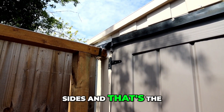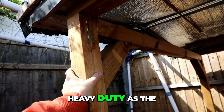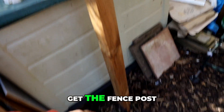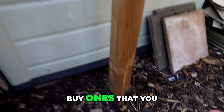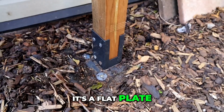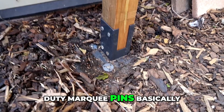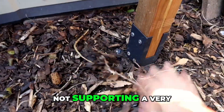As regards the supports, they don't really need to be as heavy duty as the ones I've used here. These are fence posts that I bought — a good size to use because you get the fence post bases. Although you can buy ones that spike into the ground or ones that you can concrete in, this wasn't really required here as it's not holding a heavy roof at all. Under here is a flat plate, and these are about six-inch-long heavy duty marquee pins basically, just hammered into the ground. That holds everything nice and securely — it's not required to really go over the top with that.